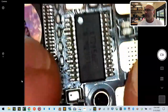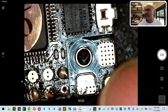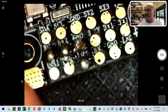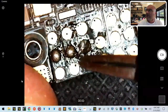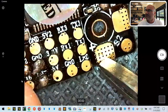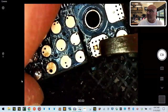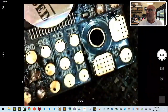So look, here's the deal. When you're soldering, I do encourage you guys, get a microscope or a magnifying glass that has good magnification on it. There are things you should be noticing. For example, when you send a board in, look at these little Hershey Kiss looking marks right here. That's what we call them. Let me turn the light down just a little bit. See that? This is a sign that the person's obviously got solder splatter.